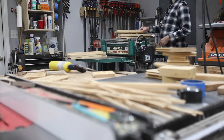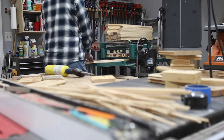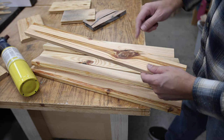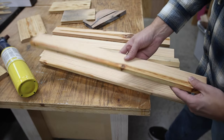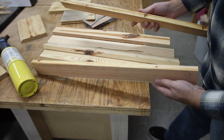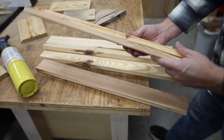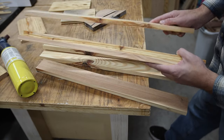These were just a hair too thin for me to re-saw and get multiple boards, so I just used my planer. I had to call an audible here. When I got into some of these boards, there is still just a piece of heart pine or something and it's full of sap — you can smell it in my shop, it's just everywhere, and this is actively sticky still. So I'm pulling a bunch of these that have that out and going to use a two-by-four I have to make up for the boards I'm losing.